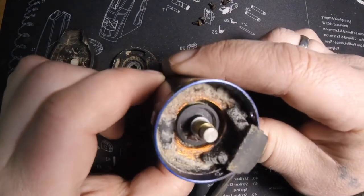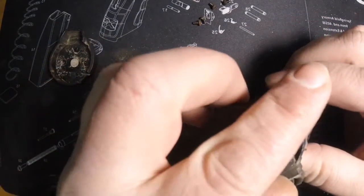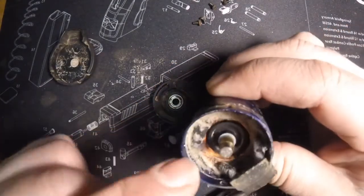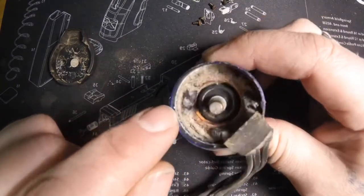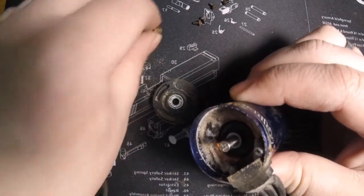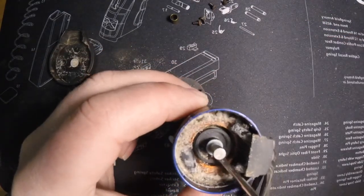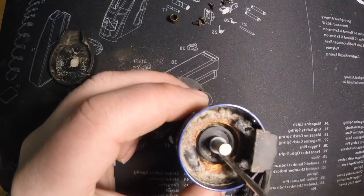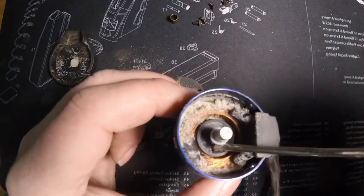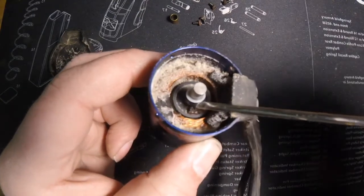Next I'm going to take a look — you're going to see here there's a bearing. Okay, this is the cap that just came off. There's a bearing right down there, and then this is that copper sleeve I was telling you about. That comes off — save that if you don't have a rebuild kit. And then there's a little washer here that you don't want to lose either. Not all motors have this washer, but this one does, so I'm going to save it.